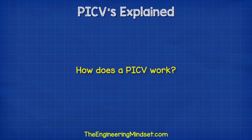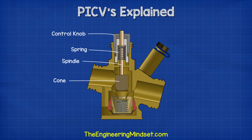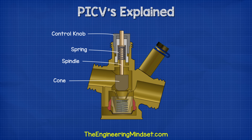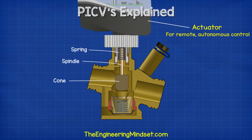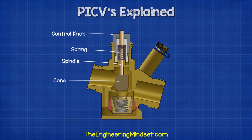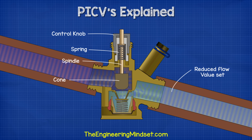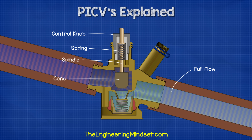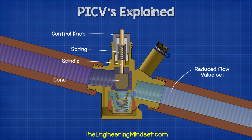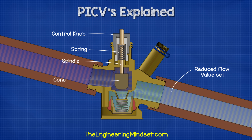So how do they work? Let's first look at the control valve. The control valve acts like a normal valve — it has a cone which moves up and down to increase or decrease the area available for fluid to pass through. When we turn the controller by hand or use an actuator to maneuver it remotely, it forces the shaft up or down to open or close the valve. As the valve closes, the amount of fluid flowing decreases; as the valve opens, the volume flow rate increases. So as long as we can maintain the same pressure difference across the valve, we can accurately tell how much water will flow through the valve at a given position. We can also lock the maximum flow rate through the valve to balance the system.